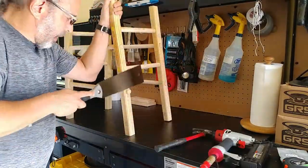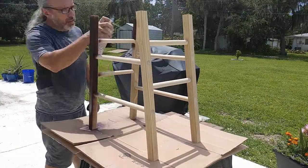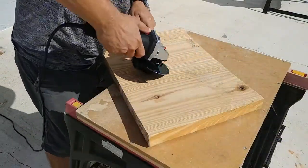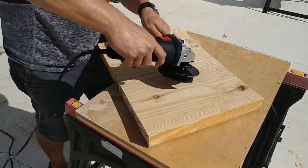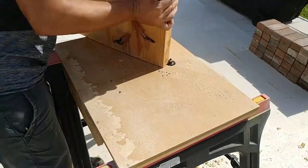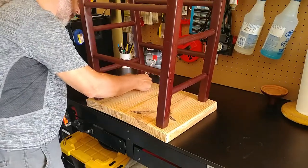After cleaning all the squeeze out, I used my $8 Harbor Freight Japanese saw to cut the ends of the dowels flush with the legs. After one more sanding session, I moved on to paint using Rustoleum X2. By now it may sound like I'm rushing the project — and I am. I got involved and lost track of time, and I skipped lunch. I wanted to get this done in one day. While the legs were drying and after grabbing a sandwich, I started to work on the top of the seat. This piece was already pretty smooth, so all I did was grab the grinder and made the valley in the middle a little more pronounced. I also rounded the edges using a quarter-inch roundover bit. The sun and heat got the Rustoleum dry to the touch in about an hour, and with a couple of hours of sun left, I decided to go ahead and install the seat.